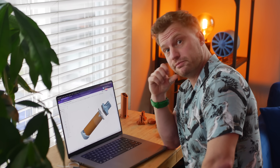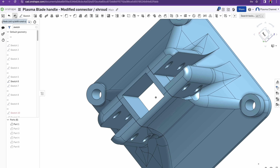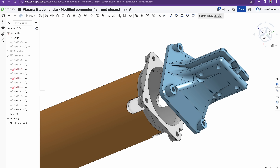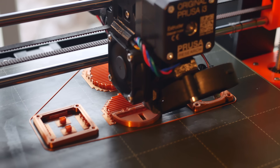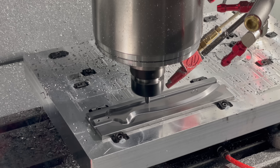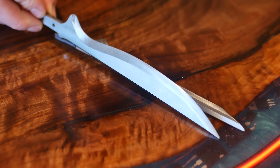Back to the drawing board for round two. I went through several modifications: decreasing the blade spacing, narrowing the air passageway, adding structural stability, and increasing the dimensions of the handle and shroud to accept a larger fan. Sending these to my printer, I felt pretty confident these modifications would help a lot. Meanwhile, Vitaly and I had a third go at machining the blades in steel, and this time — no sparks. I now had two steel blades, sharpened and ready for plasma.